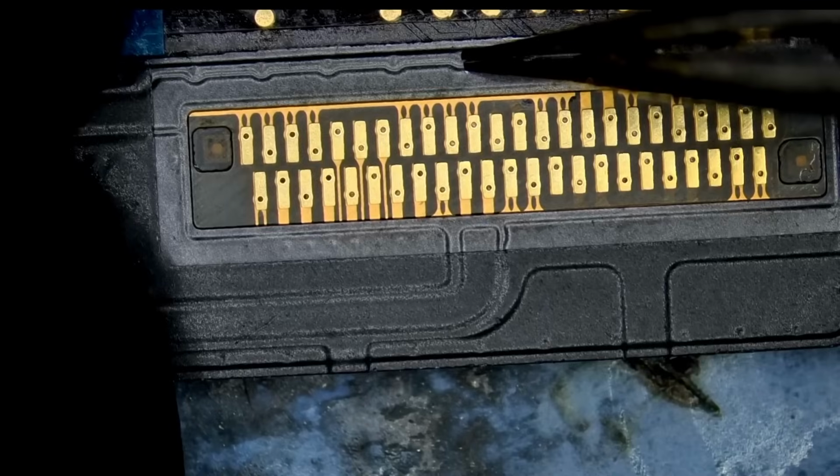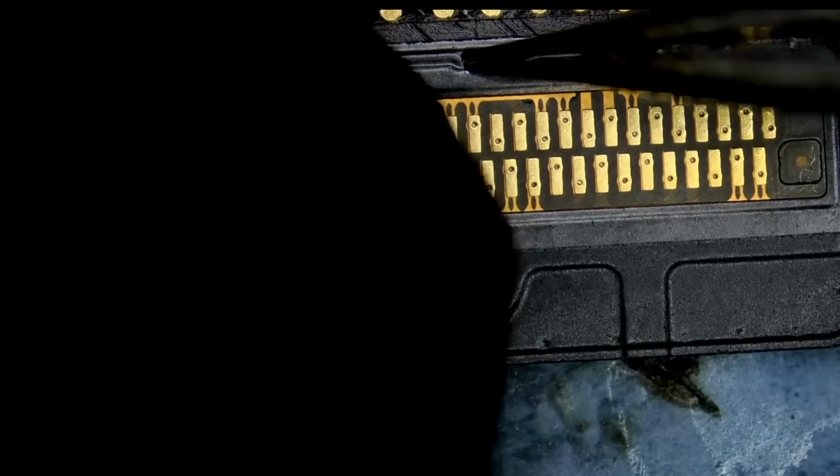And just like that, right? Both of them align. I'm going to press on that flex cable. Keep holding. Do not let go. Do not move it. Do not sneeze. Do not talk. I can talk because I'm used to it, but do not do it. We're going to tap, and add some solder on a few pads.